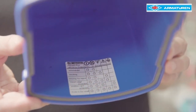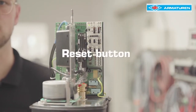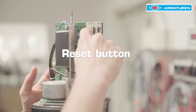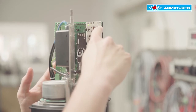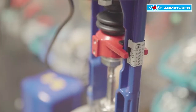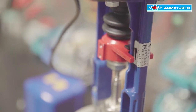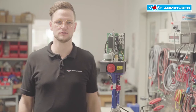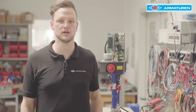Further colour combinations and their meaning can be found on the inside of the cover. The Reset button is located in the row below the LEDs. Press the button for more than four seconds and the blue LED will light up to start the initialisation process. After a successful initialisation run, the green LED lights up permanently, indicating that the actuator is ready for operation.